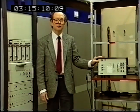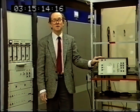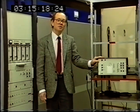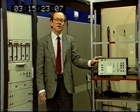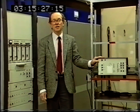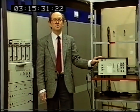As you might already know, the Black Mountain team's development work resulted in a modification that's been fitted to these generators. This expands its capabilities to provide a range of distorted ITS waveforms, again digitally generated and therefore stable. These can be used not only for the calibration of AMEs, but also for checking the operation of other equipment, waveform correctors, for example.